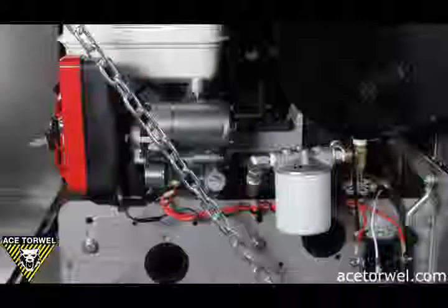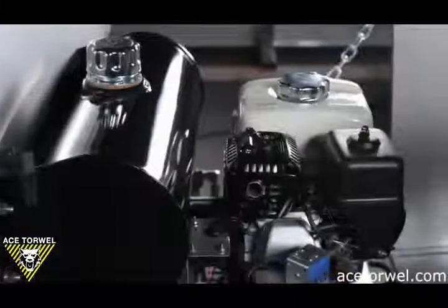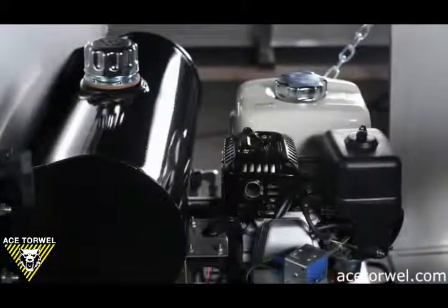It is a pump-driven hydraulic system that delivers to the 2 hydraulic motors, one for the spinner, one for the conveyor. There is a feature that throttles the engine up and down, which will give you more volume or less volume as you speed the motor up or slow it down. Proven for 1.3 yards up to 3.9 yards in capacity.